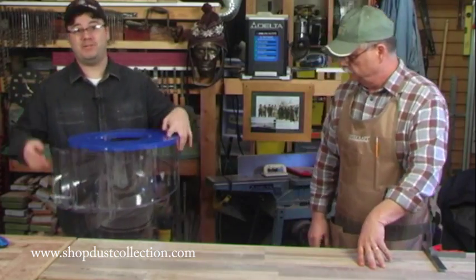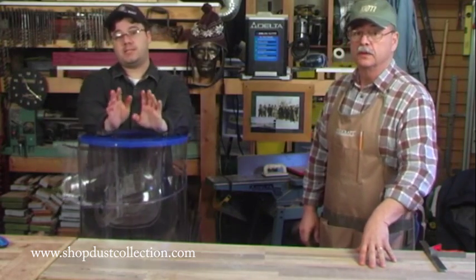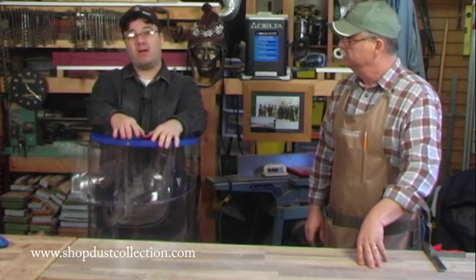What you want is a really smooth surface on the inside of your cyclone, and the easiest way to get it is to add some sort of lining. It has to be durable enough to withstand constant sandblasting by dust during use, but flexible enough to form the tight radius at the cone's bottom. Stumpy found the solution in the clearance section of Home Depot: some countertop laminate. That plus a little construction adhesive gives you an airtight liner that will withstand a ton of use. The lining was my genius idea, but the other features of this dust collector that make it so great are based on physics.